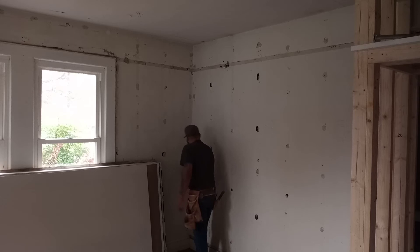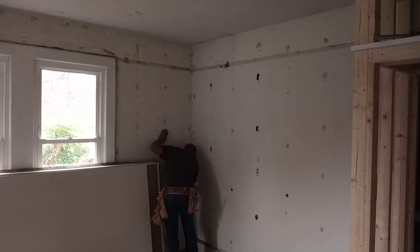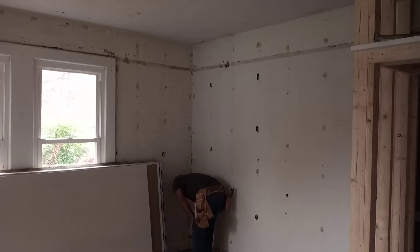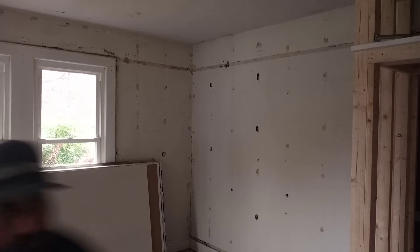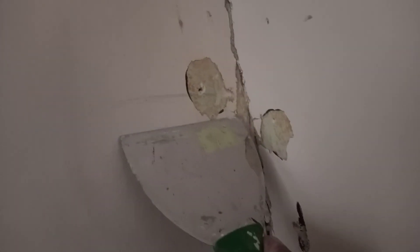We have to check it all over. Let me find a better position — I want to give you a better look at these corners here. I'm using a quarter inch drywall on the walls and a half inch on the ceiling, but as you can see it's a little bumpy. So what I have to do is just clean up all these areas and try to clean up the corners, because if it's bumpy right here then your quarter inch drywall is going to break.